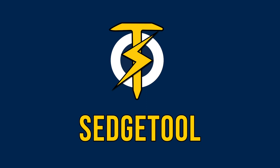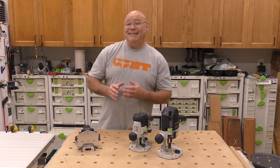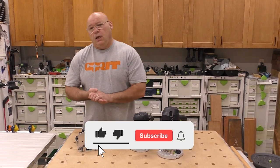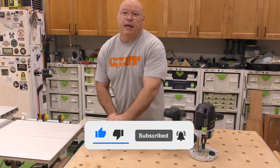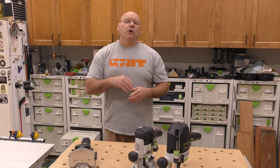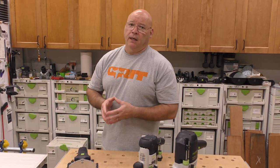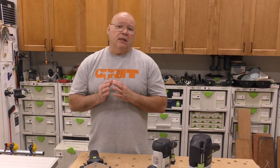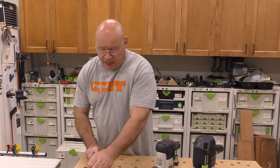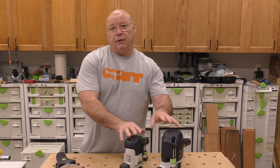So if you really think about it, the Domino, whether the 500 or the 700, the XL version, you always want to have a nice, smooth plunging action. So in an earlier video, we did a maintenance on the Domino, and I showed you how to clean the rods, and I'll show you how to lubricate the rods, because you want it to plunge effortless into that material. So now I'm going to show you how to maintain plunge rods on your routers.